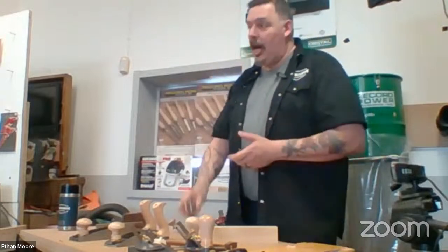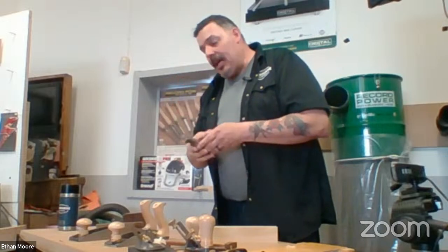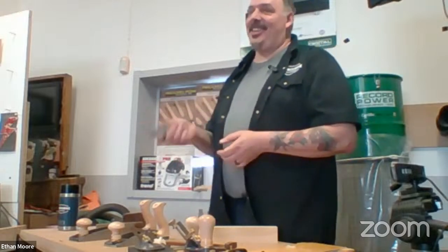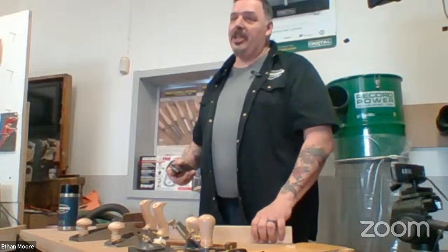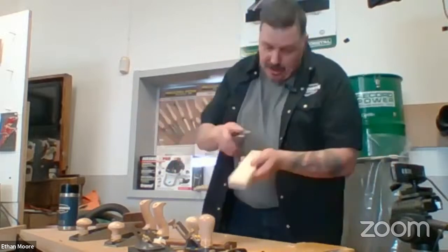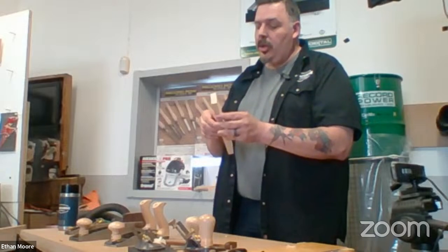If I'm using a regular wooden pencil and I need a specific chisel-tip shape for marking dovetails, I will take my block plane and sharpen the pencil to that angle so I have a nice big flat to register against as I'm working. A hand plane will cut plastic; I wouldn't use it to cut non-ferrous metals — it technically can, but you're going to have to buy more stones because it's not going to be pretty. That's why bench dogs typically are made out of brass and not steel: if you accidentally hit a bench dog in brass, it's not going to completely destroy your blade, only a little bit.